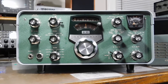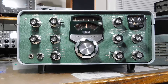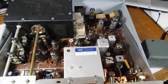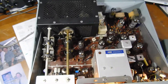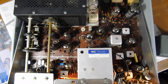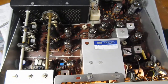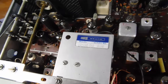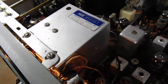It's working pretty good now. Let me take you under the hood here. This is very similar to a Heathkit HW-101, which I built many moons ago, with my first sideband transceiver. The difference is this has a TRW built LMO, which is very stable and very linear.